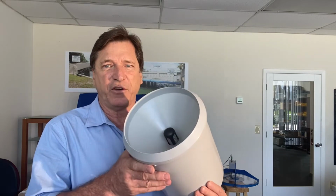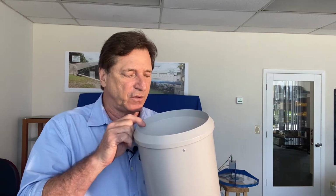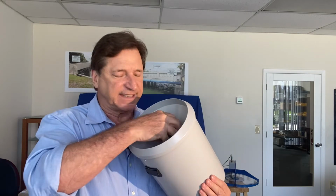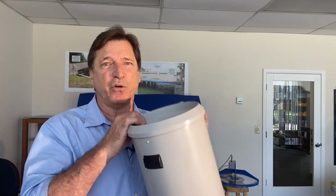So what we have here is a vertical finger filter assembly. This is about 2.5 inches tall to 3 inches tall. And what happens if there is airborne debris that's blown into the gauge or bird droppings, it will actually sit at the bottom, form a false bottom, but it will not impede the entry of rainfall. This is a really, really important feature.